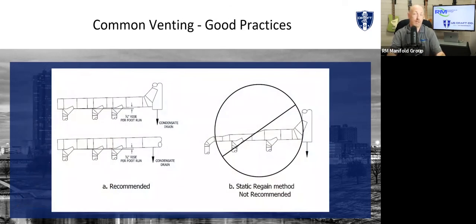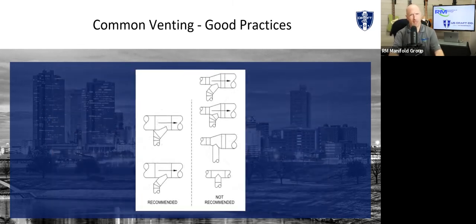Good venting practices: if you're doing a mechanical draft system, please give me a common header all the way past that last appliance. Most of the time I get a header that reduces right away, and the problem is I have nowhere to sense pressure properly. I want to sense pressure in the end cap, not sense flow — it gives me a much cleaner system. If you learned nothing else today, know that lateral T's are your friend. Flue gases do exactly what you tell them to do, so if you tell them to bang their head against a wall, they will and create back pressure. We want a nice flow merging into the common header. Boot T's and lateral T's are different — the K value is not the same. If you cannot fit a lateral T, use a boot T. Never, ever use a straight T. These cost more and take up more space, but it's the proper device for a boiler venting system.